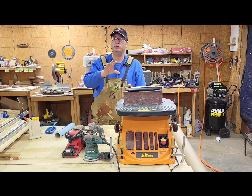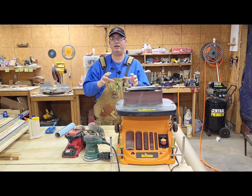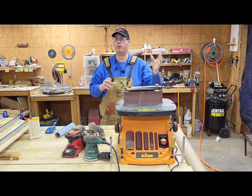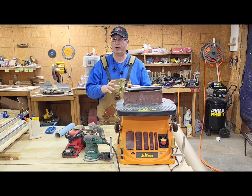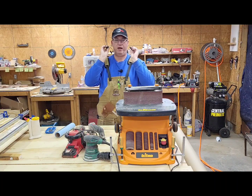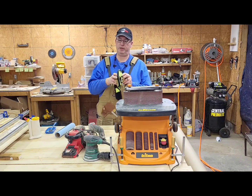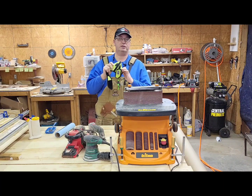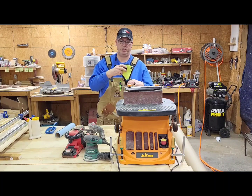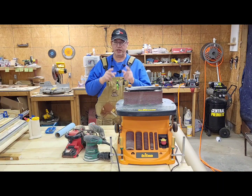I'm going to ask you about some of the ones you use. But before that, I want to talk about the proper PPE when you're dealing with things that create fine dust. We've got a fan with filters for removing fine particles from the air while we're working. You want to have proper dust collection hookups. They're also loud, so we want to have good ear protection — grab your ISOtunes or whatever you're using. We recently picked up this RZ mask and we're loving it. Make sure you have good lung protection because those fine particles will do damage. Protect yourself from the sanding dust first and foremost.